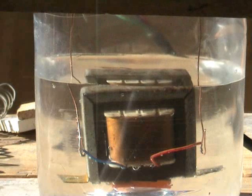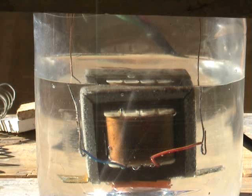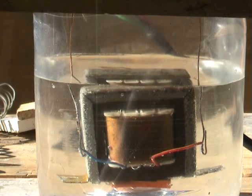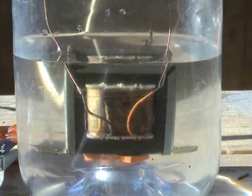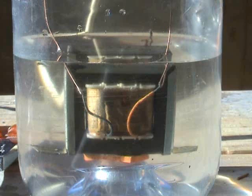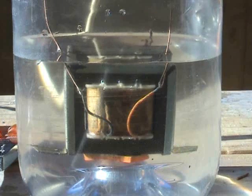Plug and play - not too much happening yet. I've changed the windings around. Secondary winding, about 15 ohms, is now subjected to 240 volts via a 1 kilowatt element. Let's see what happens. A couple of bubbles.